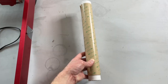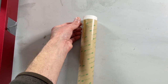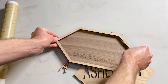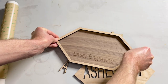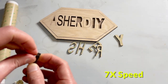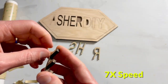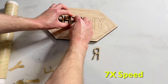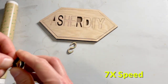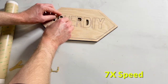The third laser shop upgrade is this 3M adhesive. It's a double-sided adhesive that is laser safe — you put it on the back of your material, cut it out, then peel off the backing and stick whatever you cut out directly onto another layer. This is really useful for me because I do a lot of multi-layered wooden projects, like the sign you see here, which is actually the project that's part of the Lightburn 101 tutorial I have coming up in this series. It just makes the adhesion process way quicker and easier. If you're interested in the specific one I use, I'll put a link in the description below.